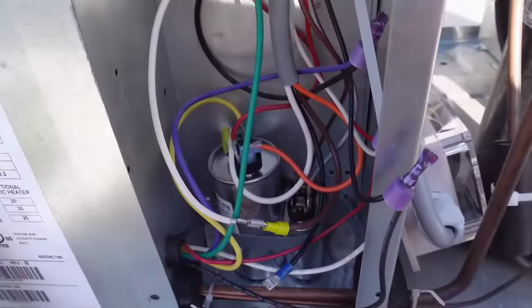Only one wire left. Our black wire is going to connect to all three of these, so we'll need to make a joining splice — cut these out of the connector and put all three together. They give you Wago clips so all three can join easily. That's basically done. I'll wrap this with a little electrical tape or zip tie to keep them in place. A quick wire cleanup, and that area is finished. All we have to do is put the putty back, seal this off, do an alcohol wipe, and stick the module on with the included double-sided tape.